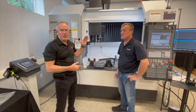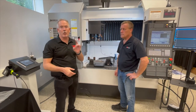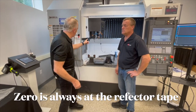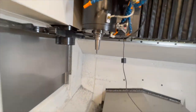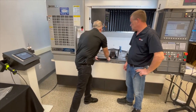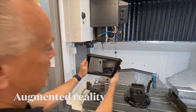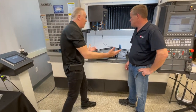We are at the very final and third stage of this one-two-three process. We got our results from the trial weight and we are now adding the correction weight — the exact weight it told us to do at 23 degrees. Tom, how did you know where zero was? We know where zero is because when we put that reflective tape on the tool — right there on that tool — that becomes our zero point, so everything is referenced from that point. And actually, on the iPad, a neat feature is I can use the camera to hold up to that spindle and know exactly where that 23 degrees is. If I hold that up underneath the spindle, it'll tell me exactly what hole to put that weight in.